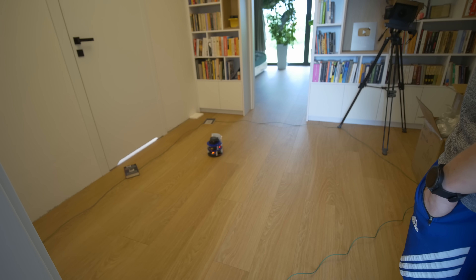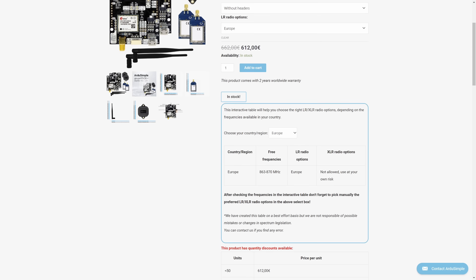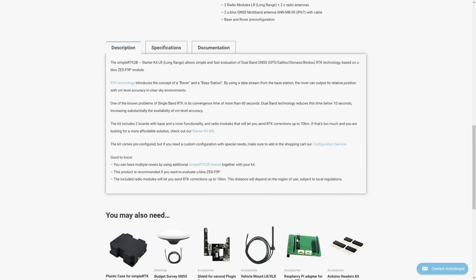It's really simple, yet so expensive. Why the boundary wire and not GPS RTK? GPS RTK means Global Positioning System Real-Time Kinematics — it's actually GNSS RTK, but never mind. It allows positioning accuracy of about 1–2 cm, which is crazy accurate and definitely good for such a project. The problem is of course the price — such modules start at around $500 and can easily go up to $1000 or even more, which is a lot of money, and you can buy a lot of perimeter wire for that price.